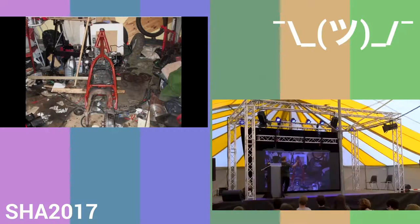Then it was aligning it in the frame. There's the frame with the gearbox now mounted to the engine, and I have to get it so as it fits in, which is not quite apparent in this photo or the next one, but I've had to tilt the engine over by a few degrees, and it's also raised up by a few degrees, so as it misses all the frame tubes. And also, with it moving around, I had to make sure that the output shaft flange of the gearbox mated with the shaft of the shaft drive to the rear wheel.